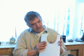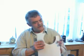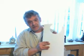The problem with working in timber is that at a high voltage, actually timber is not an insulator, it's a conductor. So you can't really use timber for this kind of thing. If you do, you're going to have to put some pretty serious insulation between any of the working parts and the timber structure that you've made. With this thing, you don't have to bother. You just build it, you're done.